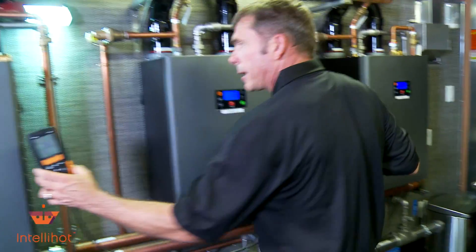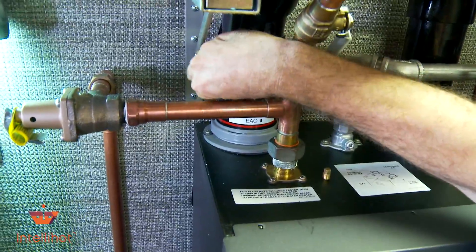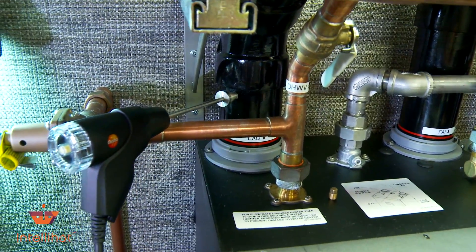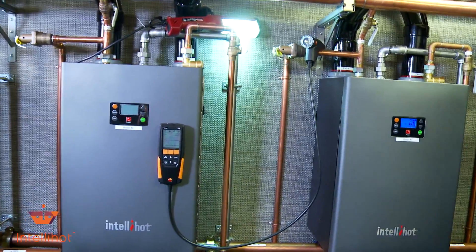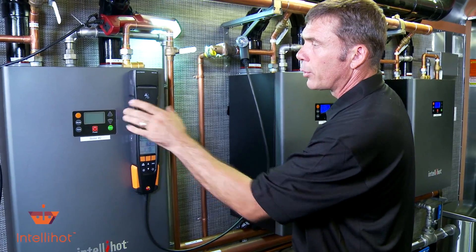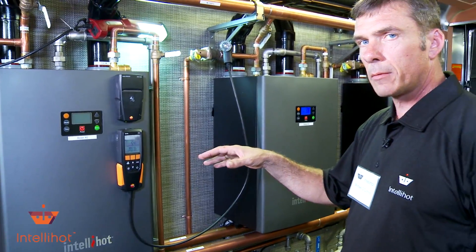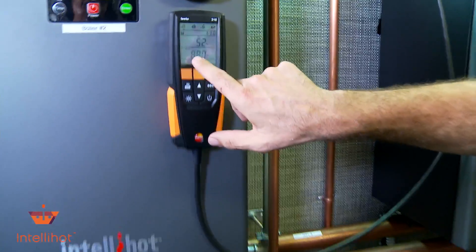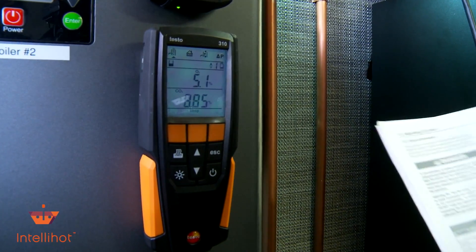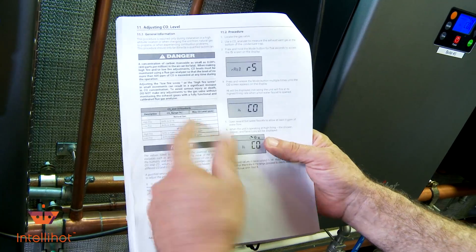You'll hear it modulating up and down, and basically I'm going to unscrew this plug I have up here in my PVC exhaust and take my little holder there and tap it in. I'm going to stick this in about center ways — that's where that's going to be. We're going to let it start monitoring and watch what our high fire gets to. My combustion analyzer can actually print what we see here, so we can prove that we did our job and made it safe. It takes a few minutes for them to settle out and read your CO2. For high fire on natural gas, we need to be 8.8 to 9.1 percent, with less than 200 parts per million.